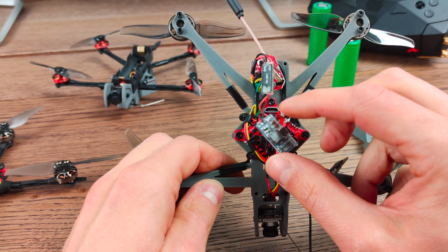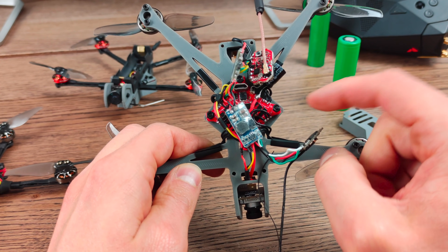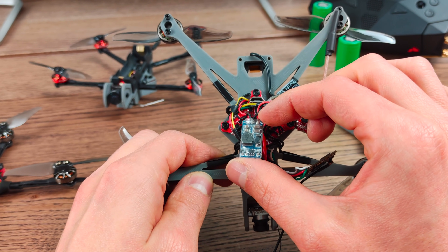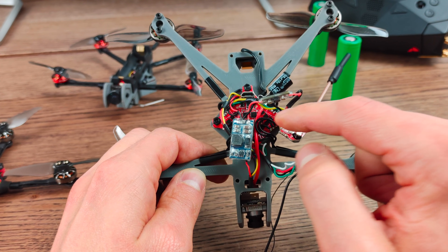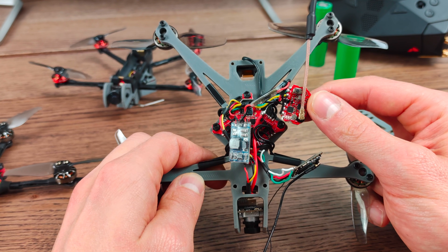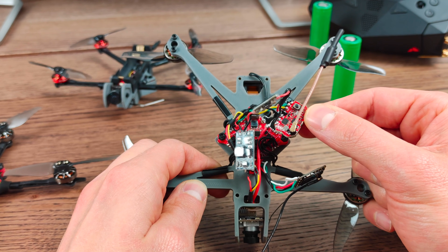So this step-up feeds the VTX — the video transmitter. There is one step-up basically in the flight controller feeding the internal 5 V circuit of the flight controller, the camera, and the receiver — the Crossfire receiver — but it's not feeding the VTX. The video transmitter is running off this separate step-up, which means the amp draw on each of these two 5 V circuits is quite low. By decoupling the high amp draw VTX from the flight controller's 5 V circuit and feeding it with this beefy 5 V step-up, these 5 V circuits will be able to go lower than 3 V. I push them down to 2.1 V, and depending on the output power of your VTX, it does work down to a bit less than 2.5 V — quite exactly what we need to harness the entire capacity of the lithium ion packs.